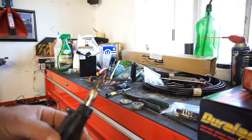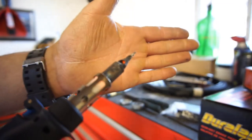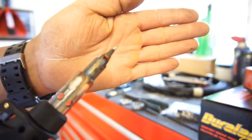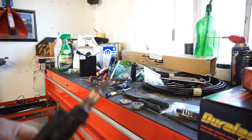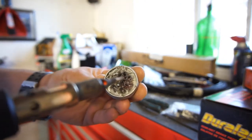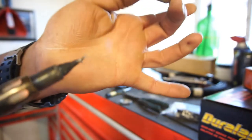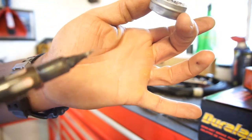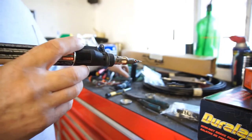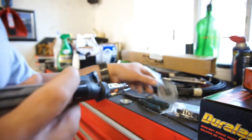The thing I like about this the most is this hole right here — you can see it's glowing red. I use that for heat shrink. And this tinning compound: you stick the tip in there and your tip has been tinned. It stinks, but it does the job.